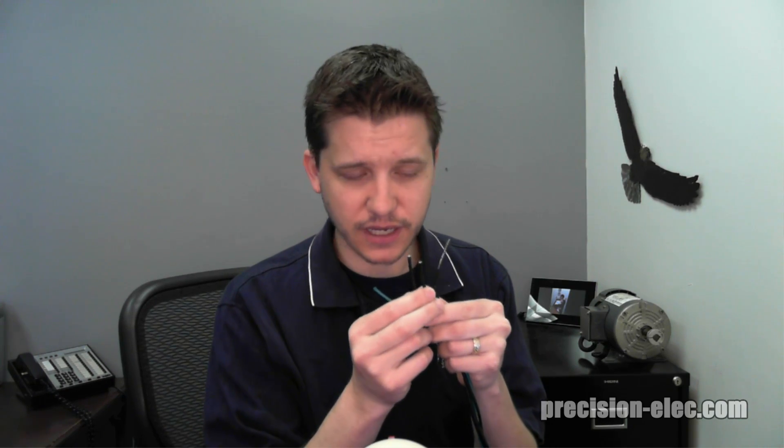You have three motor wires typically, and that would be U, V, and W. In my case they are not labeled. In many cases they don't have to be phased in a certain way — they can be wired with any of those three wires U, V, and W. Depending on how you wire them and how your motor is wired, that can affect direction. Many times you can change direction simply by swapping one of the phases of your motor leads. So that's something you want to take into consideration when you're wiring your motor. If it's connected to a piece of equipment or a load that can be damaged if it runs in the wrong direction, you want to disconnect it from the load before you start connecting things and running them, because you want to make sure that you don't break something.